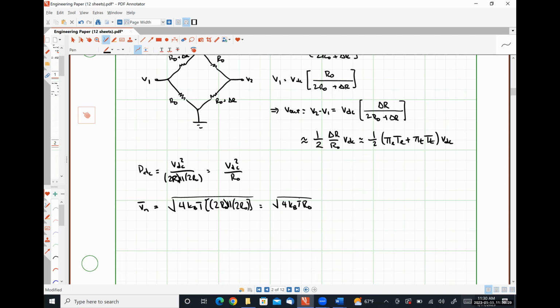So what changed here? What is the trade-off that we're seeing here? An increase in complexity of establishing this thing, because we've got to have two identical piezo resistors under strain for it to work like this. Okay. So there is always a trade-off here. We get twice the output signal voltage, but it's physically harder to implement in our system. Okay.